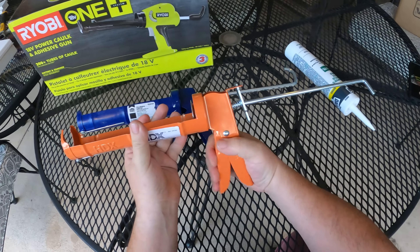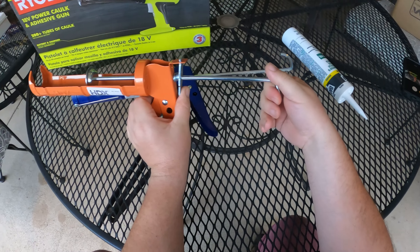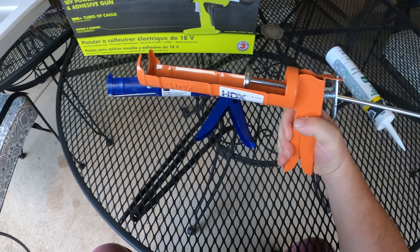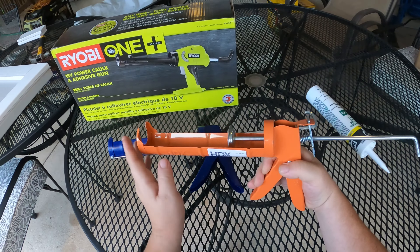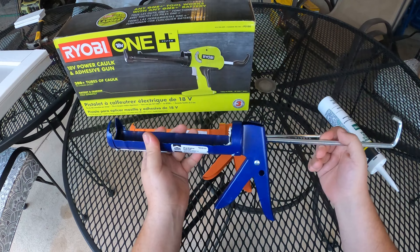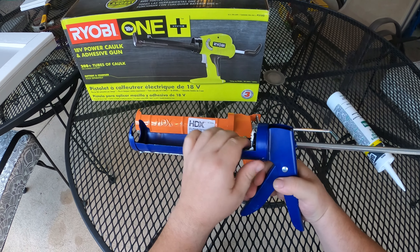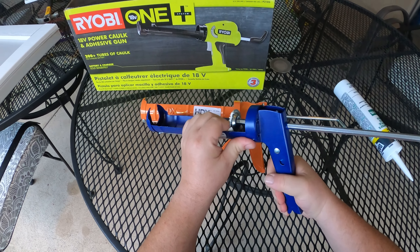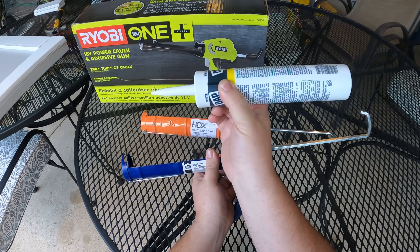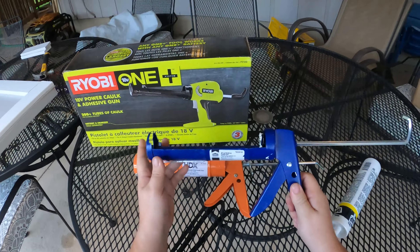What is the difference between a standard caulk gun and a dripless caulk gun? With a standard gun, when you pull the trigger it pulls forward and you can't push it back — the only release is a release mechanism. This constantly increases pressure, and the downside is you can create enough pressure where even if you stop, it'll still continue to come out. A dripless caulk gun works the same way to load, but notice there's no ratchet lever — when you push against it, it comes back. When you squeeze the caulk out and release, it recesses and takes the pressure off, keeping it from dripping. This is a really big advantage in reducing mess and waste.